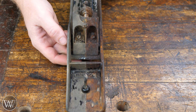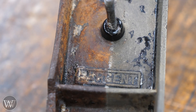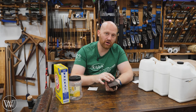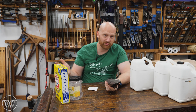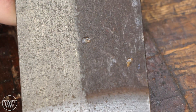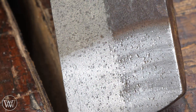The difference is quite literally night and day. It was honestly a cleaner finish than I normally expect to get from Evapo-Rust, and way better than anything you're going to get from a vinegar base. A really nice clean finish all around. Looking at the bottom side, there is a bit of pitting. I was wondering — is the pitting caused by the mixture or was it from the rust? The best way to figure that out is to come in with a wire wheel and scrub both sides, and see after wire wheeling whether the rusted side looks different. Honestly, no — the pitting is the exact same across. I liked the look of what was dipped rather than what was just wire wheeled. It came out much cleaner.